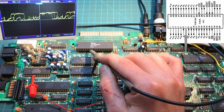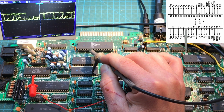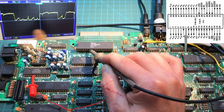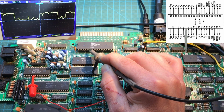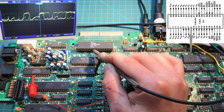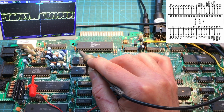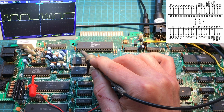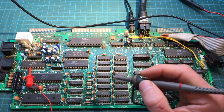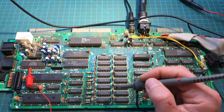So right after that, it's a little ugly. We can catch a single sequence. They're a little ugly, but I mean, you definitely see low levels and high levels. So yeah, it's probably fine. Those are fine. So look at address. Yep, address are fine. They're even a little neater. So I'll quickly check all the bits in the data bus.